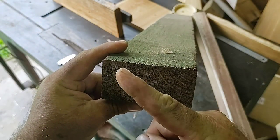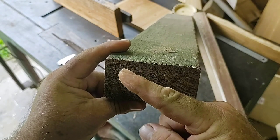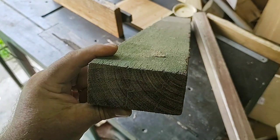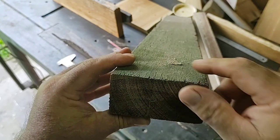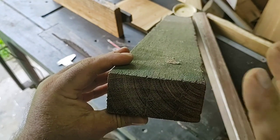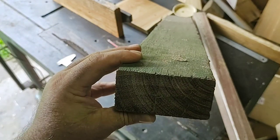I would go for grain on an angle that big, say a 30 degree angle across it. I'd accept that. From 45 onwards, I'd accept. But this is not 45. Back as you get further over here, it's probably more acceptable. It's more 45, but it's very tight near the heartwood, so you really wouldn't want that. You want it more a straighty sort of grain.